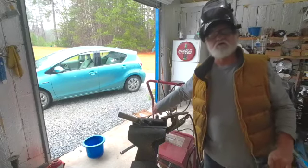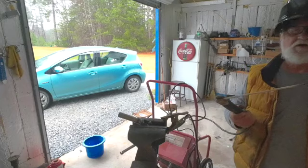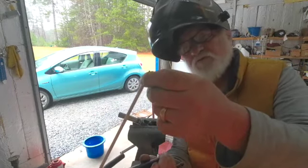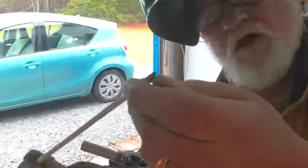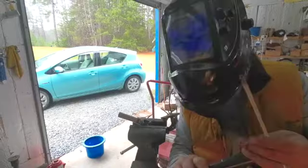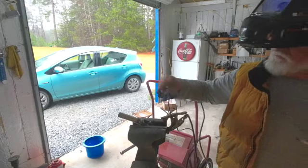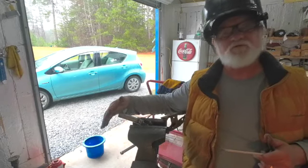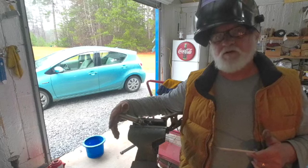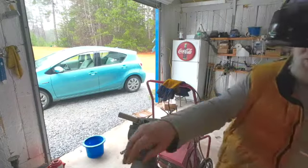Let me tell you a little trick I discovered the other day after all these years — and I thought I already knew everything. A lot of times when you're welding, your welding rod looks like this after you've used it, where it's kind of burnt off and uneven. I used to do a lot of dirty welds, which meant I was welding through grease, dirt, paint, all that kind of stuff. So I got to where I started cleaning, because it makes a lot better weld.